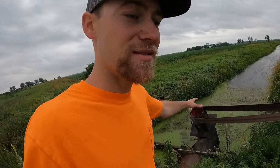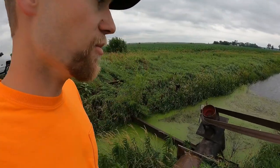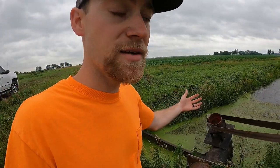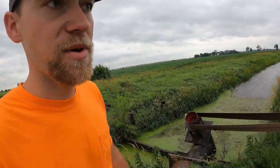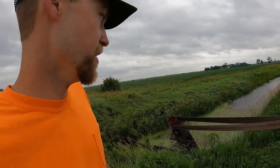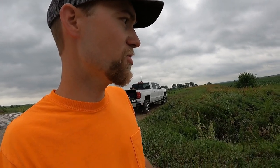So that pulley is obviously not mounted center. It's wobbling quite a bit, but there's weights in there, so the pump is not shaking too bad. So we're thinking it might be all right. Of course, we're not running it hard yet. Seems like those belts expand and contract. Once you run them a little bit, they start to stretch, and it's already sagging down onto that plate, so I can tell we need to tighten it up.